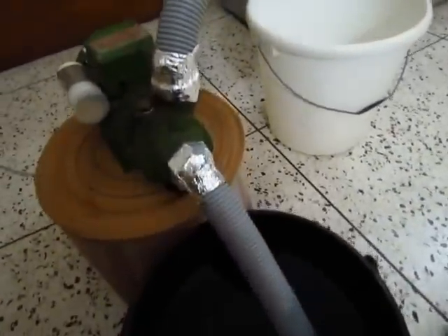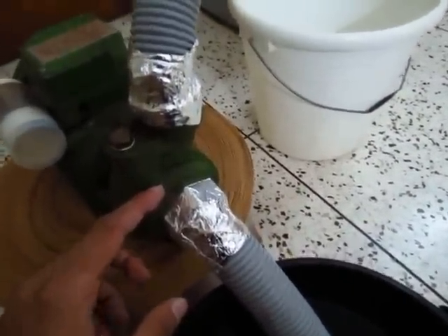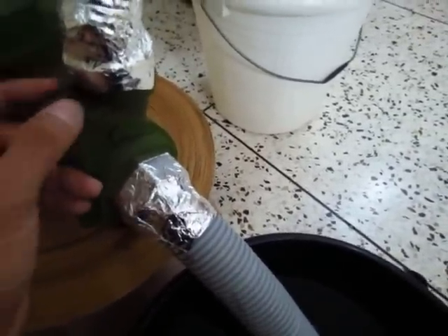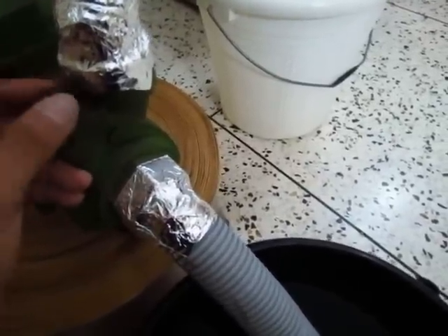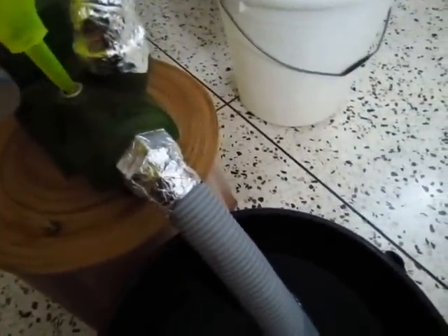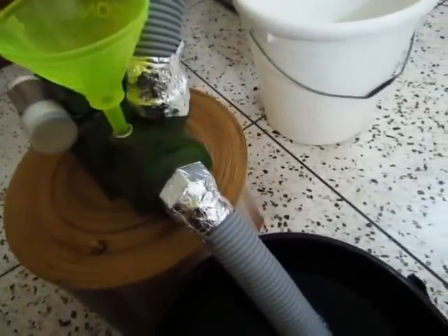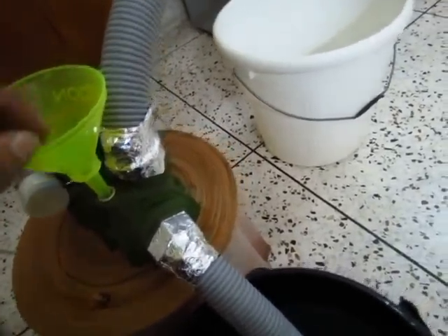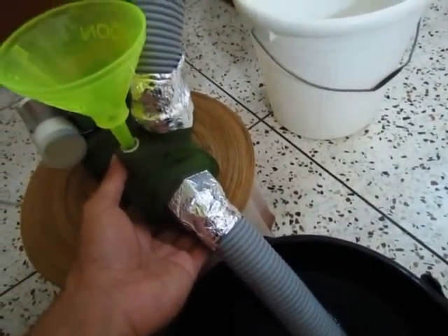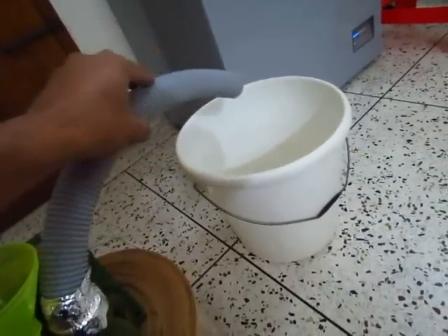So there you go, this is the problem — the water is not being pumped out. The reason is there is air inside the vacuum chamber over here. The way to get around this problem is to take off this plug over here and then fill it with water while the pump is running. I'm going to place a small funnel, turn on the pump, and fill this with water. The water is going to flow in, fill this chamber right over here, and once it's filled, the water is going to come out of the discharge right over here.